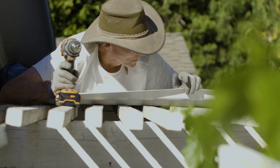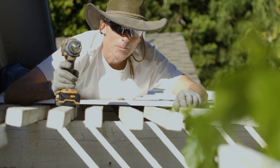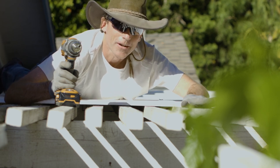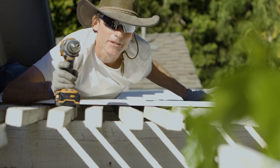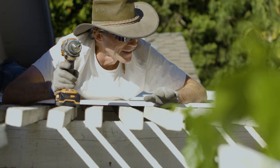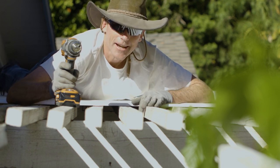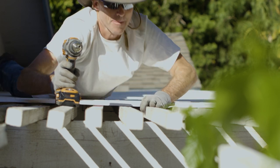So I'll remove this plastic roofing material first. Once that's gone, I'll unscrew these 2x2s. And then once those are out of the way, I'll remove the two 4x6 beams that are unsupported. And then I can take the 2x8 cross beam off. Once that's gone, it just leaves the three supported beams that I'll get out of the way, and then this should be done.